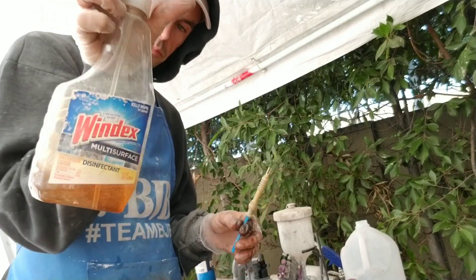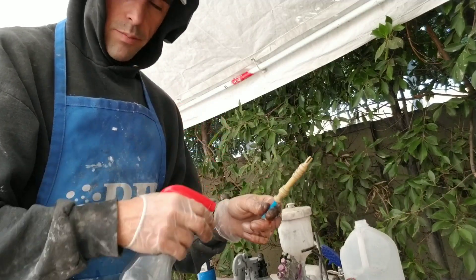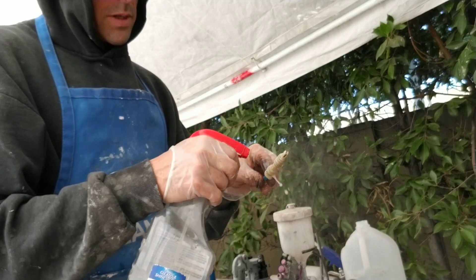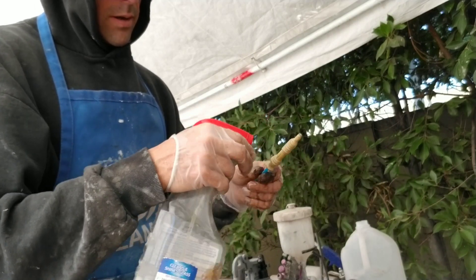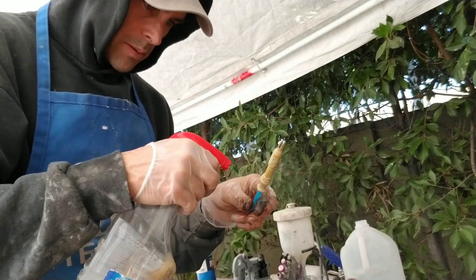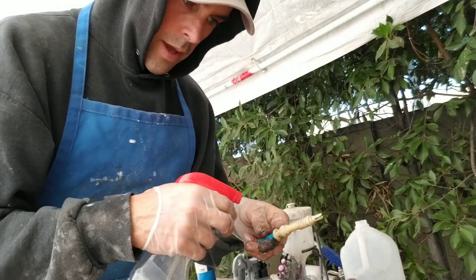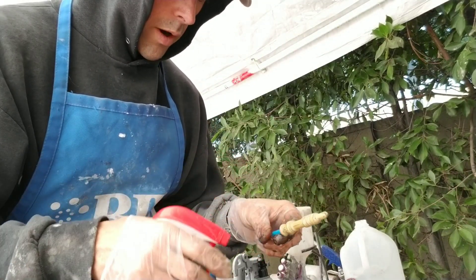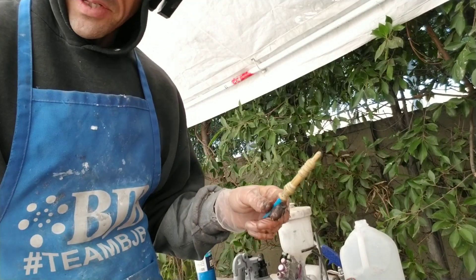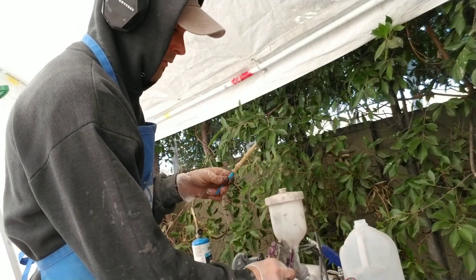This is the sensitizing agent — it says Windex on the bottle, but it's sensitizer in a spray bottle. The brown part in the sensitizer is actually the wetting agent; the sensitizer on its own is clear. I'm going to spray the surface real good, making sure to get all the nooks and crannies. These little guys are tricky because they sometimes have areas that don't get sensitized as well as you'd like. You want to look for any spots repelling the wetting agent — if they're there, it's not going to develop with the silver. Keep moving the part to keep the sensitizer on the surface because from the sensitizer step to the end, you never want to let it dry out.